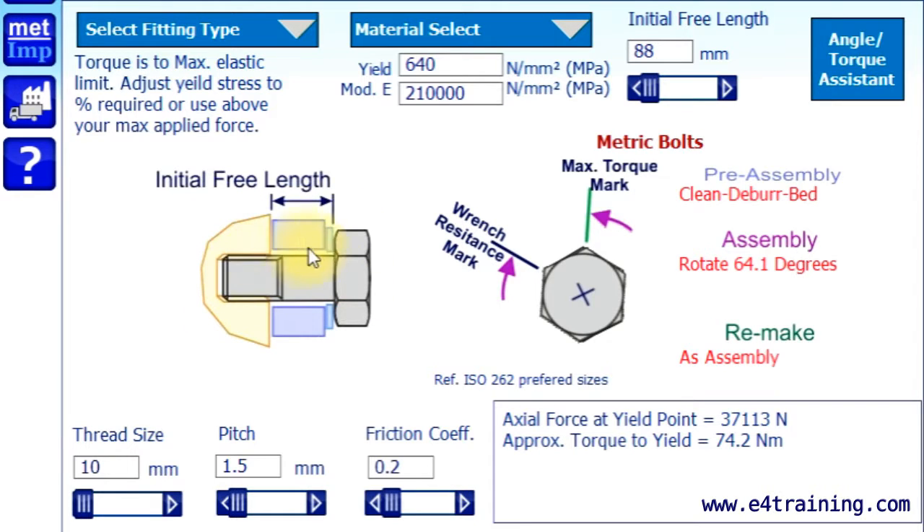Really what we're trying to do is to make sure that in service, you don't achieve any stresses in the bolt that are greater than what it's clamped down to. So as long as the stress is not changing in here, you increase the fatigue life of the bolt. If you clamp it down loosely and the forces are continuously acting on it, that will fatigue the bolt more quickly. So that's the whole point of this.